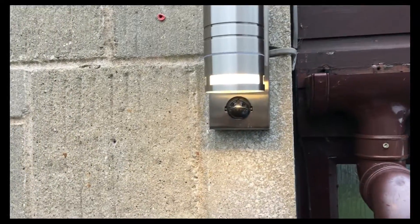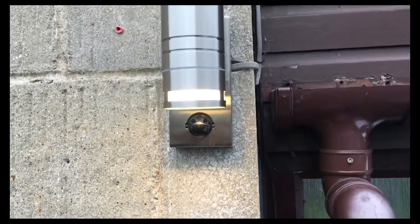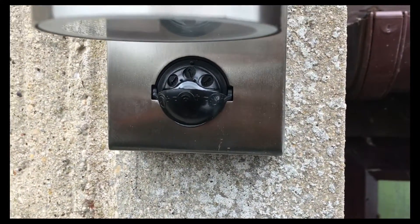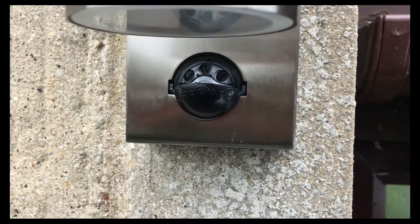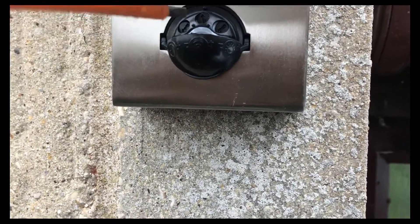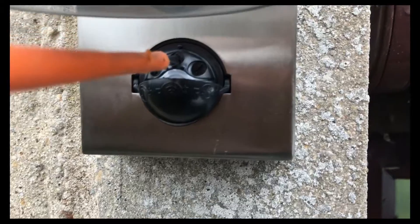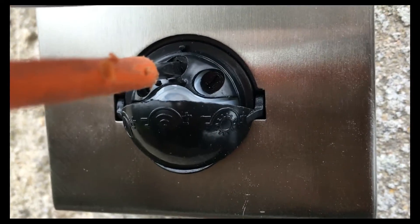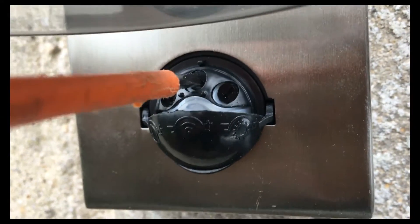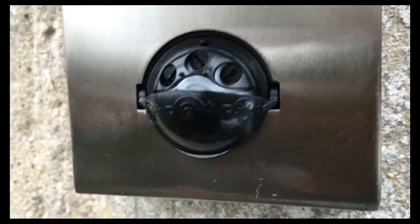It's important that you turn the electric back off when altering the adjustments. So we'll start with the sensitivity — small flat-head screwdriver, just sat that in the groove there. I'm going to turn that clockwise so that we get maximum sensitivity. There we go. The next one is time.